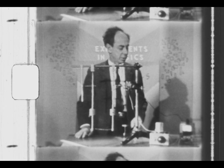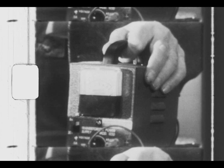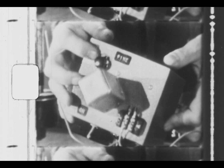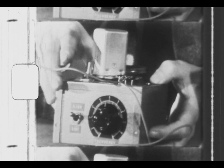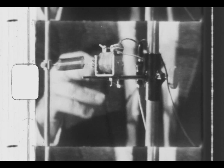That's done by using these power supplies. This is the power supply that operates the relay — it's a 30-volt supply, or a 6-volt one. It puts it on 30 and runs the voltage up, actually off-scale, to the full voltage in the little supply. This is a multivibrator, which is battery-operated, and it determines the frequency of the relay. It has an on and off switch on the top, and a fine control of the frequency. On the front, there's a high-low switch for the frequency and a coarse control. This is battery-operated, so it should be left with the switch off unless it's in use. When I turn it on, you can hear the relay clicking, and we can also watch it closely. The frequency of that is determined by these settings.